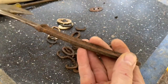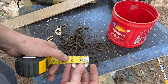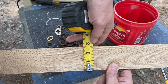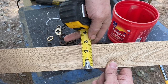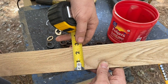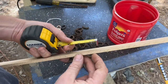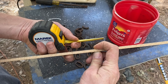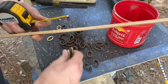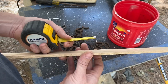That took a little bit of doing to get the handle off. Down at the bottom it's about 1-7/8, so I think I'll just start out cutting 2-inch long washers. It's supposed to be 3-inches wide, but at the lumber store it's actually 2-1/2 inches, so I'll be ripping this in half — it'll be about an inch and a quarter wide. The handle is 6-3/4 inches long, so that means I will need 27 pieces of quarter-inch material. I'll be minus the thickness of the plastic spacers I'm going to put back in the handle, but if I have a few extra washers cut, that's not going to hurt anything.